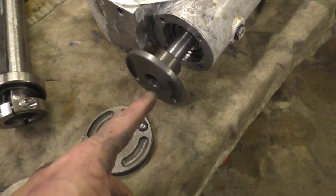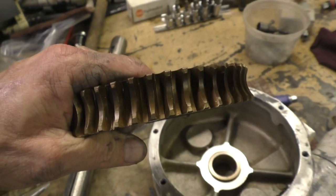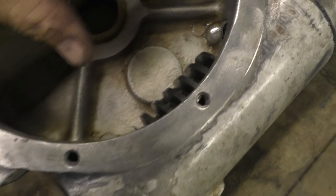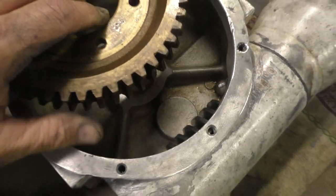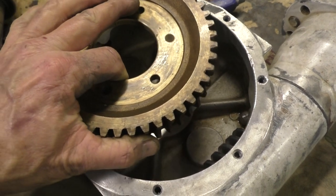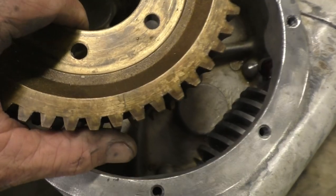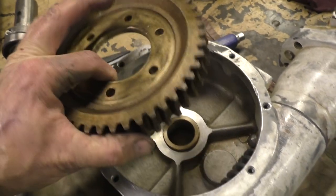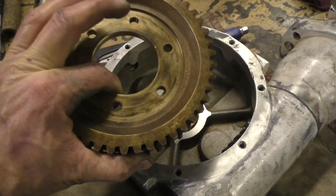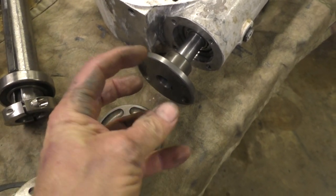Everything is fine and dandy in the world, but we have also learned that there is a little bit of slope to this, of course, and there's slope to the teeth on the gear there. In a really bad situation, this thing apparently can slip, right, and make that screw turn. Now I would think that you destroy this before that happens, and the anchor winch doesn't even have it, but this thing has a protection against it. It's a brake. And this is that brake. And remember, this is turning that way.